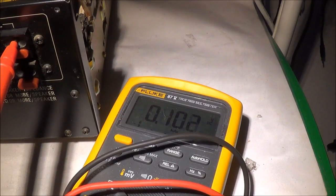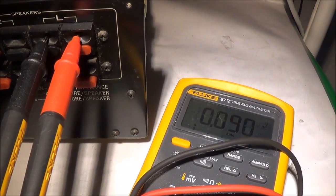I've got the voltmeter attached - you can see my test leads - and I'm checking for DC voltage. We don't want any DC getting to the speaker coil and possibly damaging something. So here we go, starting things up and bringing up to full line voltage. Looking at the voltmeter: okay, that's fine - point zero zero nine volts, and it's even dropping down more.